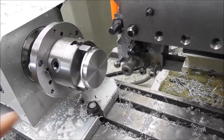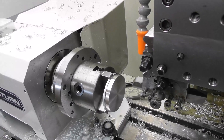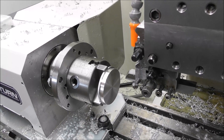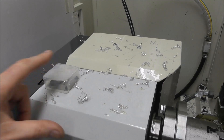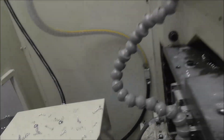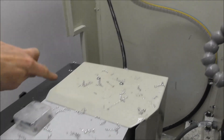Power is a limiting factor. The accuracy issue was not too bad — the headstock didn't warm up as much as during the tests, and once it had settled in I could machine parts to within one or two hundredths on the diameter. A couple of important details: I think it's really important to have a little cover on your indexing key, otherwise that critical area is going to get full of chips. You also need a cover over the belt and motor area to keep out coolant splash and chips.